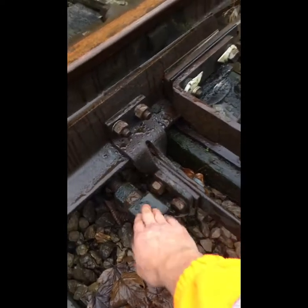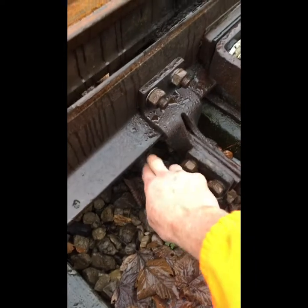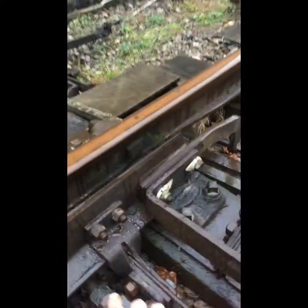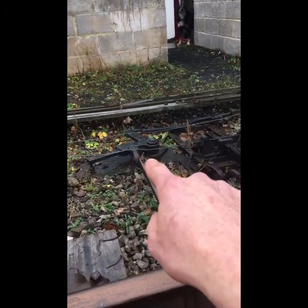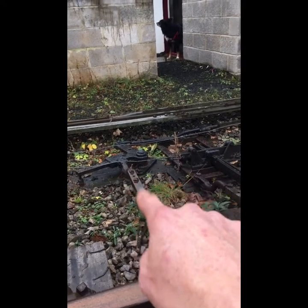This we call the PA — the precise adjustment. On that you have two locking nuts and two internal nuts to do adjustments. Should you need to do any large adjustment, that's done on the stroke crank, which gains or loses stroke off the lever. Our points here are quite close to the box, so we've lost a lot of stroke — it's right into the crank there.